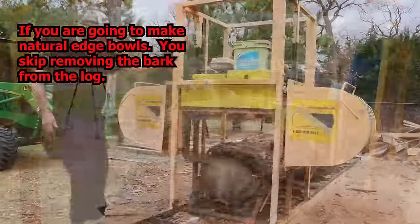We're gonna take them in the shop like we did yesterday and cut them into these circles. For these 22, it took about 30 minutes. If I've got 66 of them, I'm gonna spend an hour and a half in the shop cutting these out on a circle jig. So we've been at this 3 hours, four if you're slow, and we have cut out, circle jigged, and brought them to this table in 4 hours: 66 turning blanks. That's why this is so efficient.